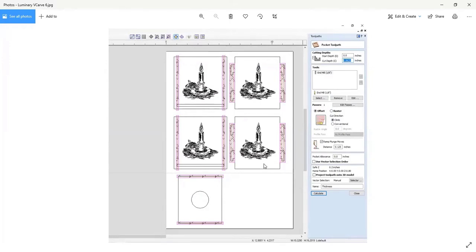I'm doing tabs and slots here, but think about this with cabinets for a second in your mind. You've gone into SketchList and you've designed your cabinets. And I personally, when I'm making cabinets for my own home, I like dadoed shelves and stretchers. It's the best way to build a cabinet. It's the strongest way to build a cabinet, and everything is located on the CNC. So that's what I like to do.